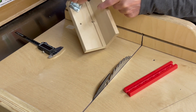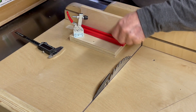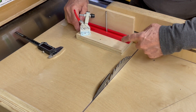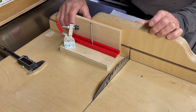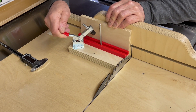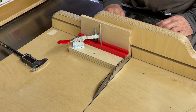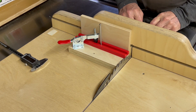So I built my little jig. It's got the centering hole for the 6 millimeter guide bearing and the groove for my template. I'll use the guide bearing and the center hole and press that down into the template. I left the jig a little bit shy of the end of my template so that I can locate my template relative to the edge of the saw blade. Once I have that fixed, clamp that down, then I know that this bar is 202 millimeters wide.